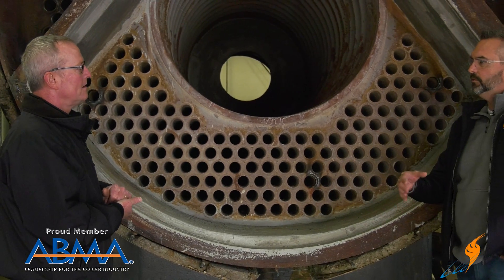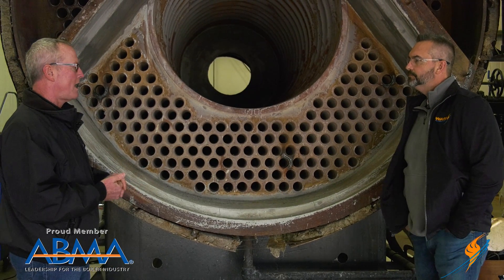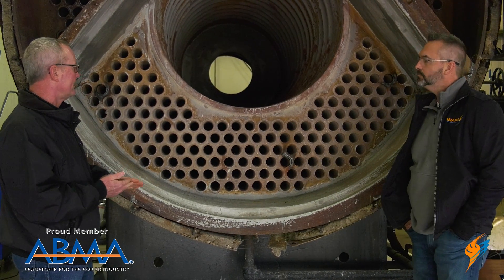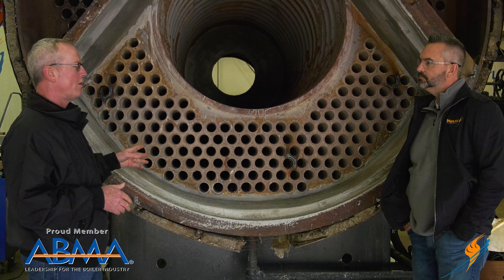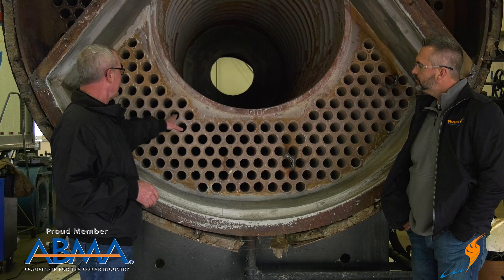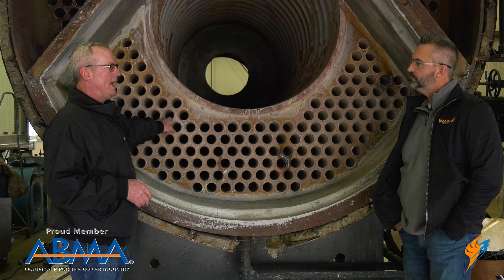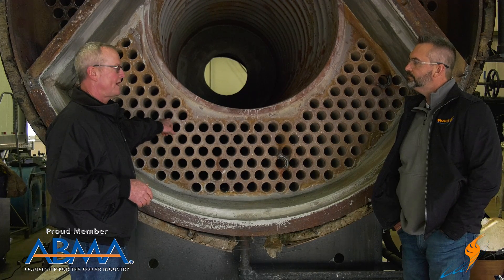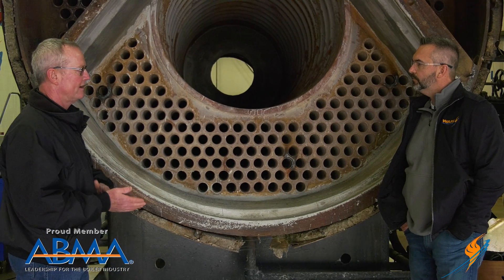That's definitely experience we've had over the years with the many boilers out there and different designs. We've done a lot of repair work on these boilers and seen a lot of different designs — we know what will work and what won't. Sometimes we'll get a used boiler in that's 15 years old, rolled and beaded, and they're not holding. We'll change it up, put new tubes in, seal-weld them. Forget about it — it takes care of itself.